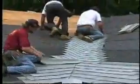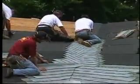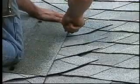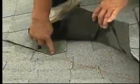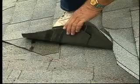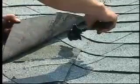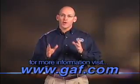Next, apply shingles to the unshingled side. Make sure that the shingles extend past the center line of the valley so that they can be trimmed properly in the next step. Trim the shingles as you install them using a chalk line to ensure a neat installation. Crop 1 inch on a 45-degree angle from the upper corner of each end shingle as you install. This will direct any water back into the valley. Finally, embed each end shingle in a strip of asphalt plastic roofing cement 3 inches wide. For more details on specialized valleys like the California Valley, see the GAF Elk website.